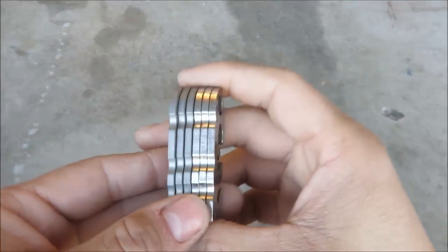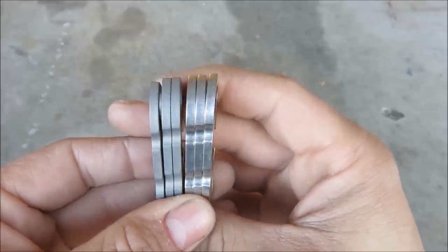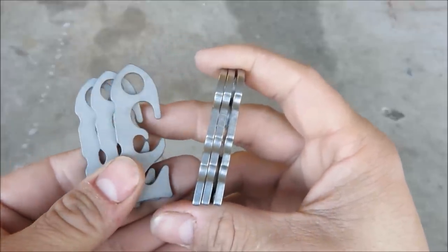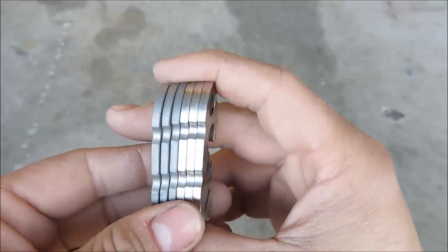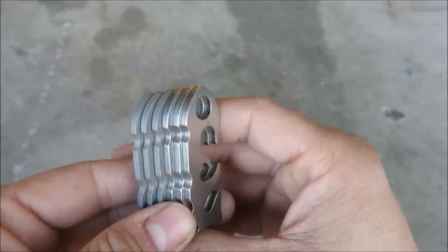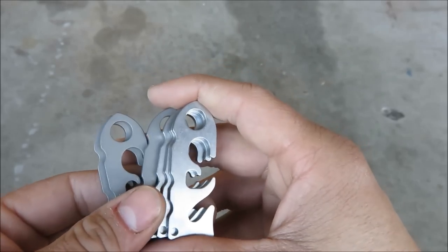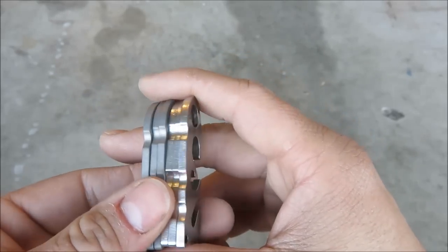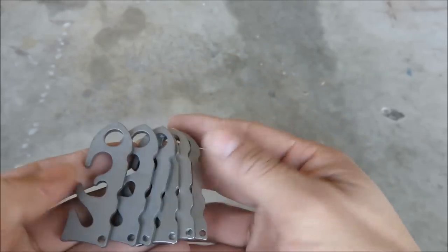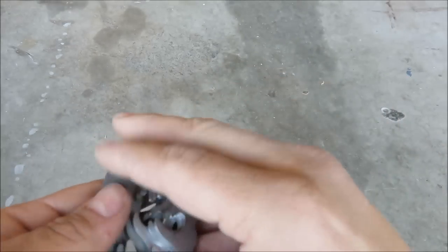Now for Diesel Junior — the three on the right are how they came directly from the manufacturer, and the three on the left are some that I'm tumbling right now. I wanted to tumble them further because you can still see the laser marks on the right ones as I rotate them, which you'll want to get rid of. I also wanted to further soften the edge just a little bit, so I'm in the middle of the tumbling process, and I'll take you over to the tumbler so you can get an idea of how it works.